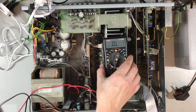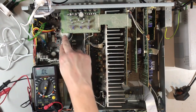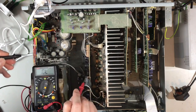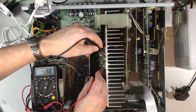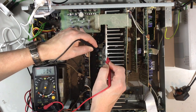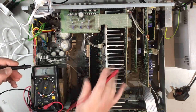The other thing we can check is on the power rails themselves, the DC bus side. The DC bus comes to the power amp section — all the output power transistors on this heatsink are powered from the same power rails from these capacitors. We can access the main positive and negative bus on the centre pins of these power transistors. Comparing one to the other — it seems to be climbing, which looks like what we'd expect from the bank of capacitors. There don't appear to be any dead shorts from positive to negative rail or from either to ground. So maybe the problem here is not the power amp itself, but the rectifiers.